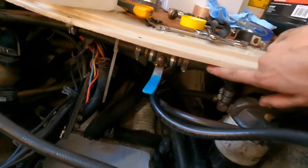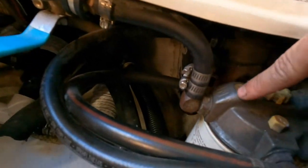We can follow the fuel line and find our primary filter. My primary filter, or off-engine filter, is a Raycor with a clear bottom. The clear bottom allows you to see if you have any water or gunk in your fuel, so it's good to check this every so often. We'll be pulling this off along with the filter and giving it a clean.